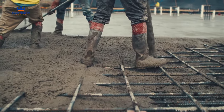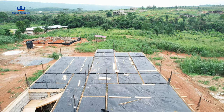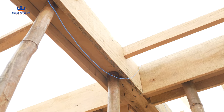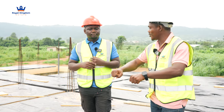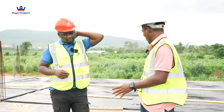So I want to know — what are these black rubbers for? Well, they are for two things. One, to protect the plywood that is going to receive the concrete. Two, some people put it just to give a nice soffit underside when you remove the board. But if you see the way the rubbers are crumpled, you will not get that effect because there's been a lot of rain.